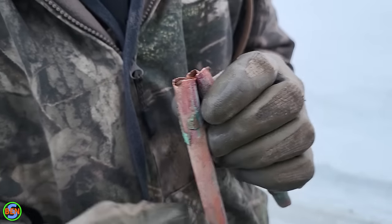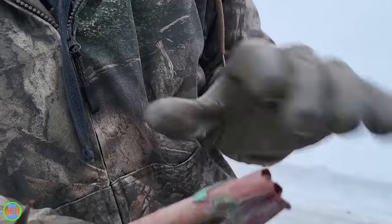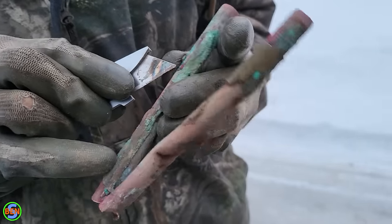High water volume through a small pipe, combined with heat, and it was laying on the clay between the gravel and the clay layer — there's probably more corrosive material in that soil. The whole pipe is coated in verdigris, basically encased in a green sleeve of corrosion.